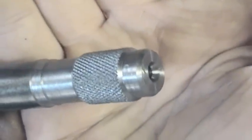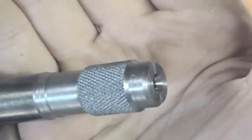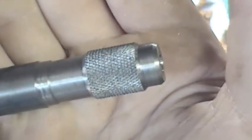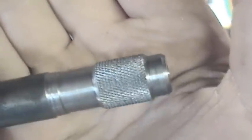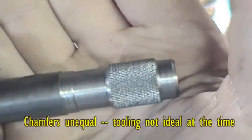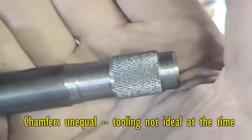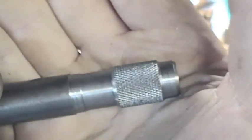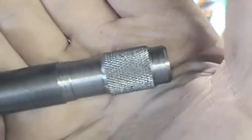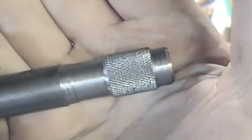I'm just going to wire brush this real quick. There's our piece — it's been centre drilled so I can use a live centre to give support. That's given me a fairly clean knurl. We could in fact go deeper than that, but the idea here is just to show you what's going on — reducing the stress on the spindle and tailstock quite dramatically because of the straddling over top and bottom centre.